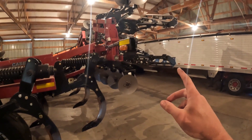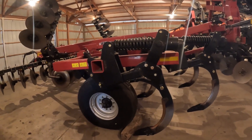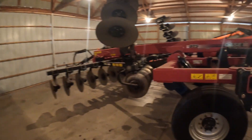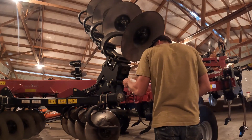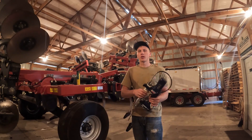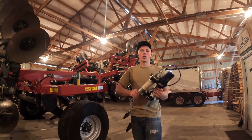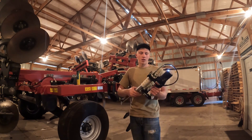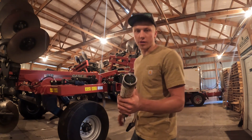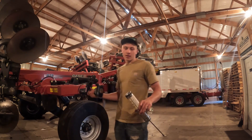It's got a nice basket on the back that breaks up a lot of the corn stocks. Unfortunately with how dry it's been, this thing's going to pull really, really hard again because the ground's going to be really firm. Each one of the disc gangs on the Ripper has a bearing, and each one of those needs to be greased. I've already gone through one whole tube of grease, so I'm swapping that out for a fresh tube. Each tube's right around $8, so I'm already $8 in just on grease.